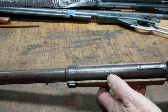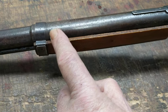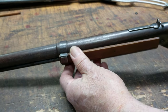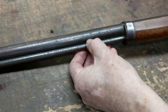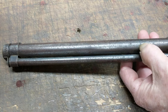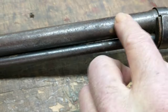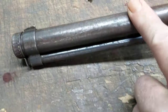We'll travel down the barrel just a bit. Here you can see where the gun's had a lot of contact with a hand, because it's rusty and the blue is gone. But now we're acquiring what is called, in the trades, patina — and that's basically just a rust blue process that happens with guns over time. Moving down to the barrel proper, you can see there's still some bluing left on the fake magazine tube, but it's chunky. You can take it off with your thumbnail, but you don't want to be more aggressive than that because you don't want to scar the wood — you want that underlying brown color to stay put. Somebody got a little heavy with a scratch somewhere; I don't know if we can blend that or not, but we'll try.